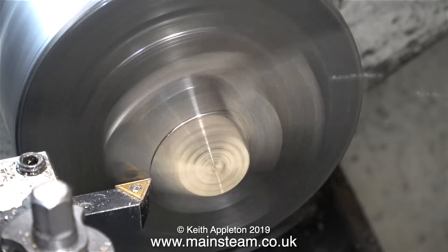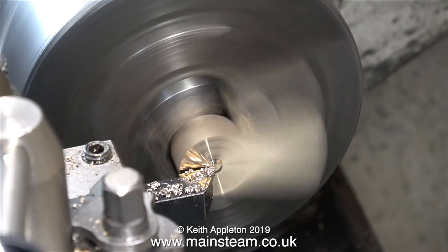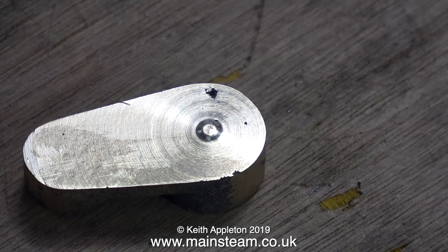This is a second pass. I've speeded up the video to make the whole process take a little less time. I don't machine any more of this crankweb, otherwise it would be too weak. And look at the front face - there's quite a large blowhole in the casting. Most blowholes are ok, but this one out of my box of old castings is not.